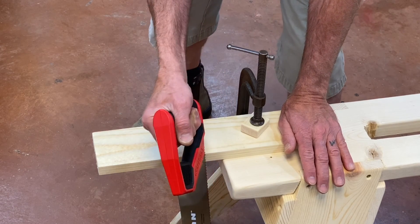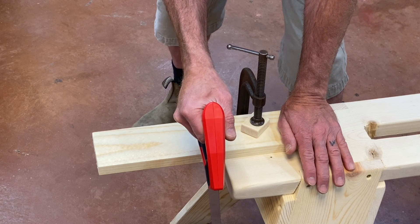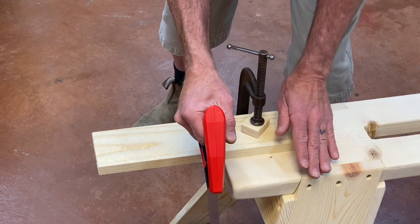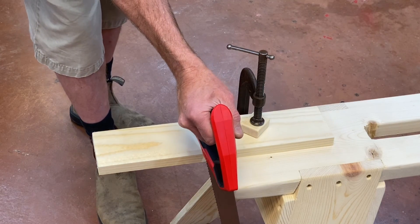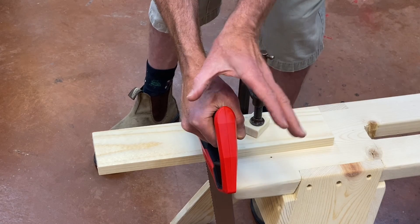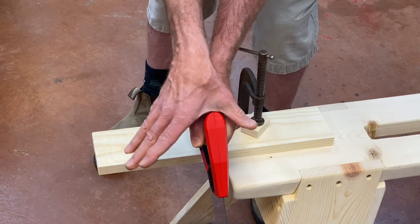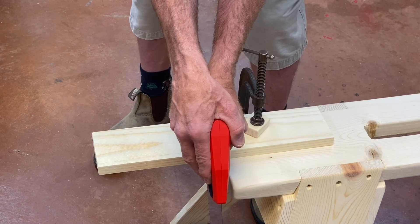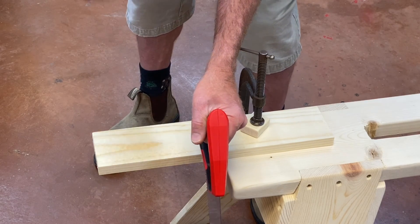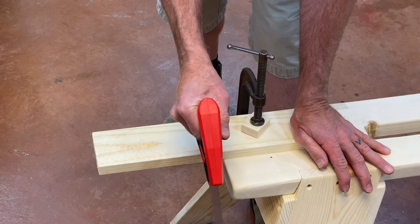Pull backwards to make a small cut that will guide the saw. If you're the adult helping the child, this is the hardest part — getting started. Do it together: ask the child's permission to step around them, put your hand over theirs, careful not to crush their hand, and wrap your fingers around so you can guide the saw together. When you sense they're getting the hang of it, take your hand away. Pull backwards three times to get started.